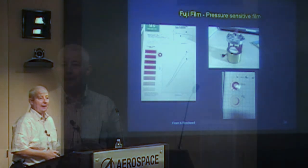Yes? This is a question to you or maybe Jose. Can you check with SEM whether your crystal is correctly poled? Well, we can. There are ways to check the poling. All we need to do is put them between two contacts and actually just apply pressure and then just measure the voltage. So we should be able to figure that out. That's not too terrible. But I must say, sometimes they put a little dot on one side, say which is the positive side, and sometimes that dot carries over to the next crystal, so you find dots on both sides. So it's actually quite easy to make a mistake and think one side's positive and the other one is. So it's best to check.